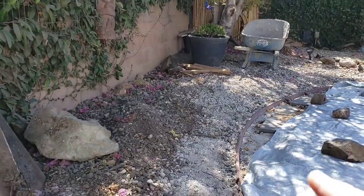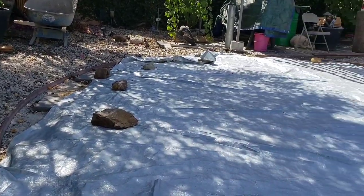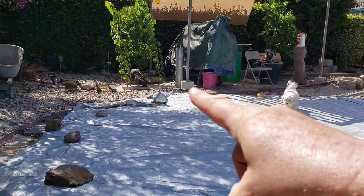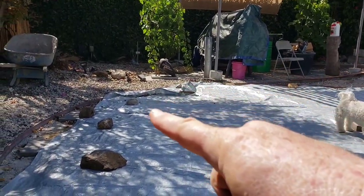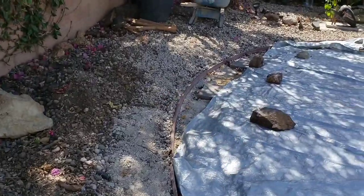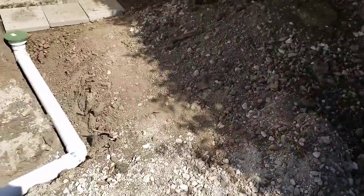On this side of the pool basin is my brick wall. You can see the rock is kind of sloped up toward the wall because it used to slope down to my lawn. You can see where all that water comes from when it rains — it slopes this way and the rain will probably end up trying to get up into this area, which I don't want. So I'll end up putting a French drain around this area or at least recontouring it and sloping it down toward the gate.